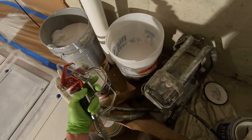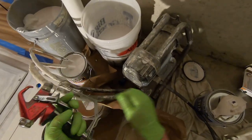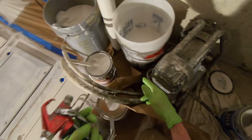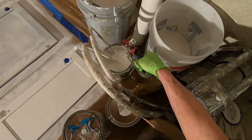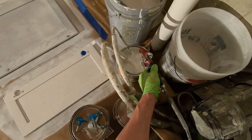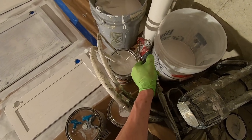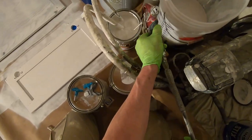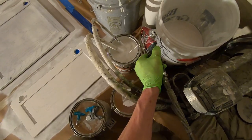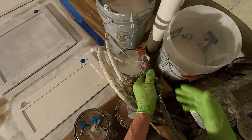I don't want to spray this under pressure, so to take the pressure off the gun I'm just going to put it on prime again, just circulating the paint. We can slowly do a little water there, and now I can flip it back over to spray. Now I've got a solid spray. Now we've fully circulated the water out.